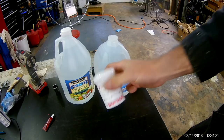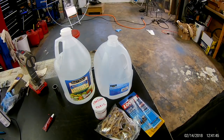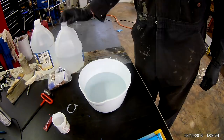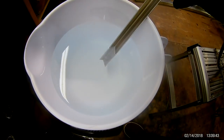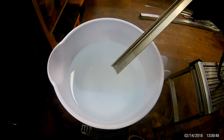I decided that in addition to the manual abrasives I had used on the inside of the fuel tank, I wanted to do a chemical etch as well. So I used sodium hydroxide — it's well known to react with aluminum. After just a few seconds you can see it starts bubbling and chewing up that metal, giving it a good surface for the epoxy to bind to.